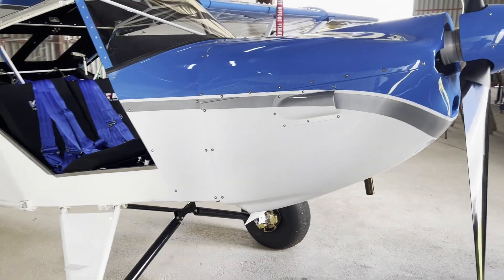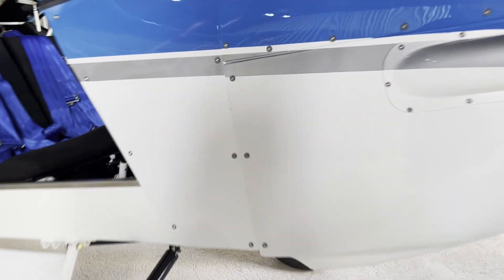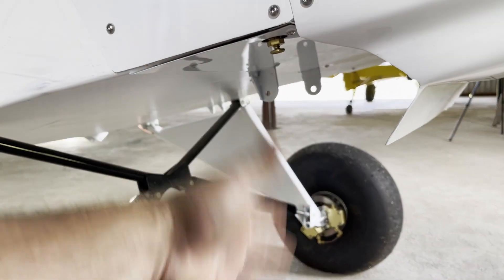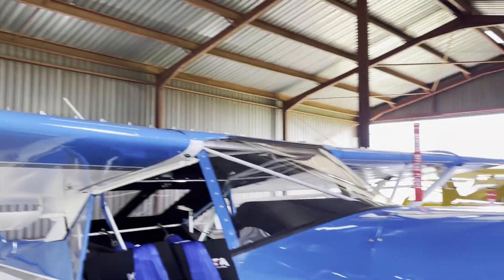Before we start folding the wing we're first going to put a trestle underneath the tail section of the fuselage, whether it's a nose wheel or a tail dragger. This will assist you in folding the wing so that the wing does not run away from you and you lose control over the folding process. The first step is to drain the fuel from the main tanks — the easiest way is to remove the fuel drain valve and put a drum underneath and drain the fuel. There must be less than a quarter tank of fuel left in the main tanks; it's better to drain all the fuel.